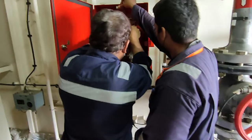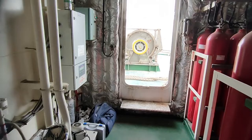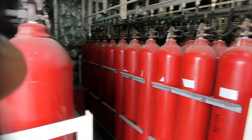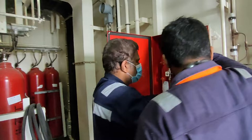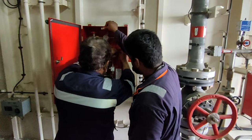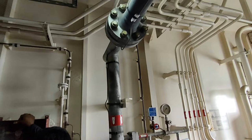The check will be carried out on the pilot cylinder. The maintenance plan on board is to be prepared based on instructions given by the flag administration, as well as MSC.1 Circular 1432 and MSC.1 Circular 1516 as amended. Maintenance, testing, and inspection of fire protection systems and firefighting appliances are to be implemented. Surveyors confirm that these inspections are carried out as part of the safety equipment survey in accordance with the maintenance plan.